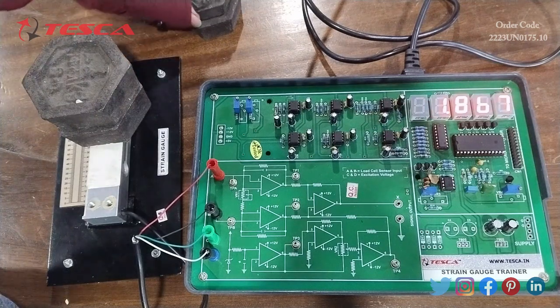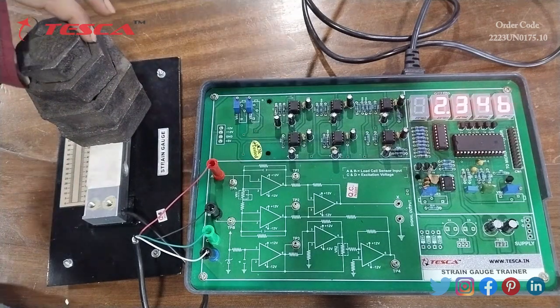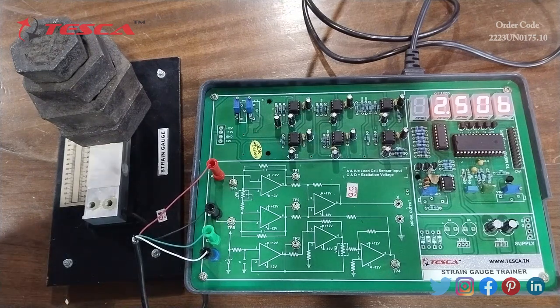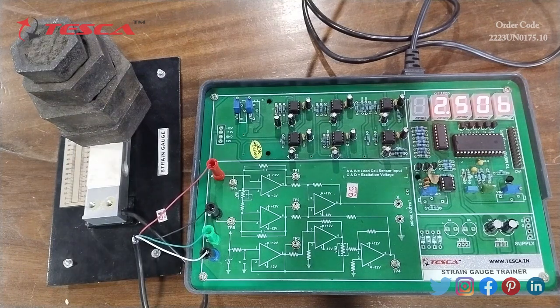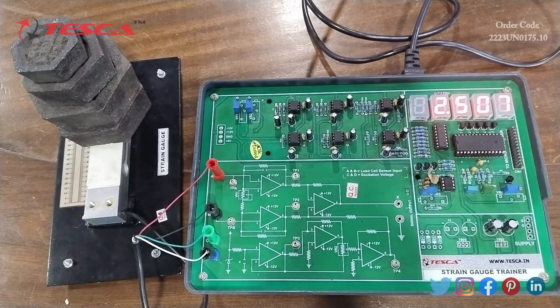Like that, we can apply more weight and see the result. You can see the total weight is showing 2.506. Apply weights to the sensor and see the corresponding changes in the digital meter. The reading in the seven-segment display will change as per the weight introduced on the load cell and will indicate the weight in kilograms. We will compare these readings with the actual value by counting the weight introduced, and we will increase or decrease the weights accordingly. After that, we will plot a graph between actual weight and the value displayed on the seven-segment display.